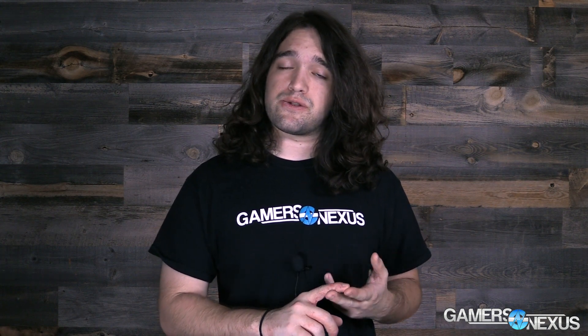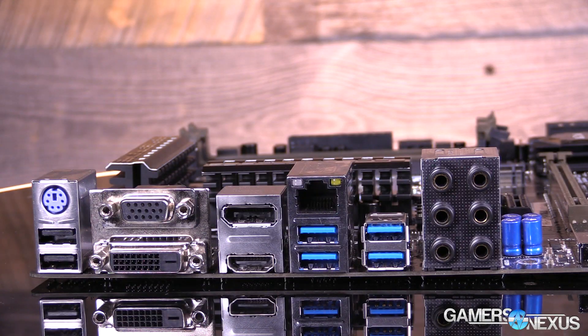For the features on this motherboard, there are two SATA Express ports which can double as SATA 3 ports, so you can use them as SATA 3 if you don't have Express devices. There are four SATA 3 ports, and one M.2 gumstick port which consumes four of the PCIe lanes on the H170 chipset.